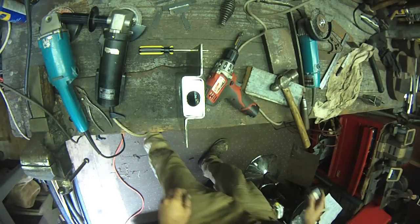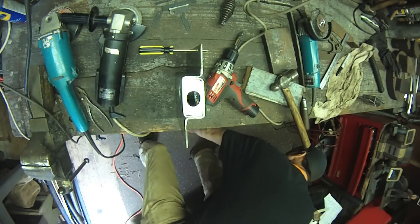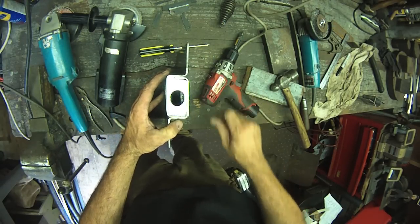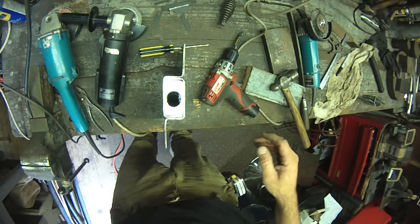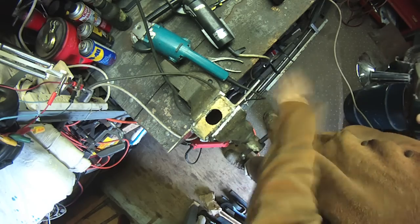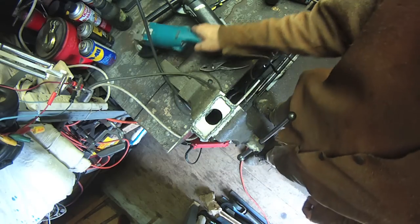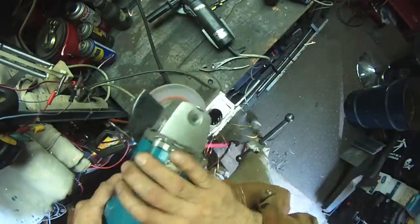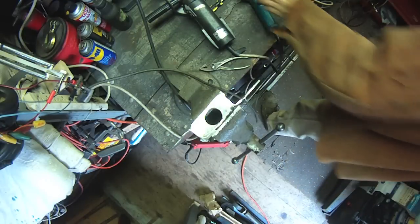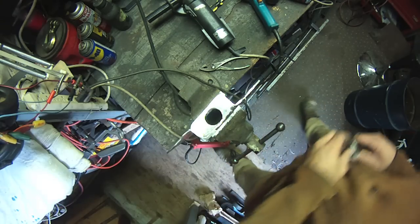A little trimming, a little tapping. She's gonna fit like that — that's a pretty good dry fit and that's not even welded in there. My plan is to weld this one all the way around and then grind it out. Straight off the welder — 0.035 flux core. Give it a wire wheel, let's see what it looks like. That is very manageable. A little flapper wheel on it — that'll work.